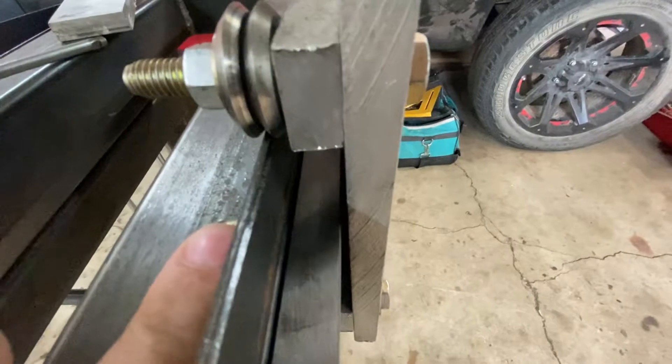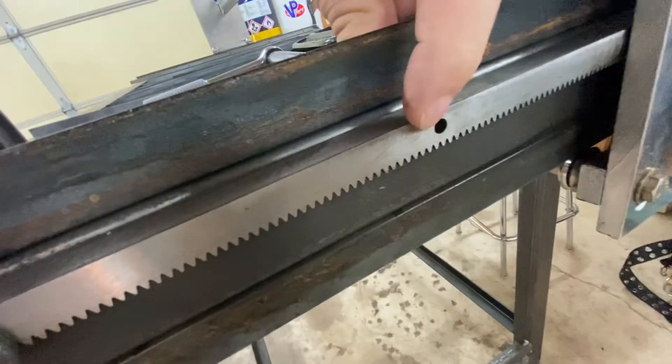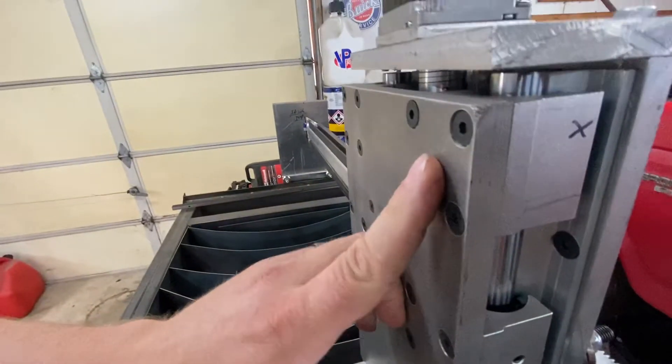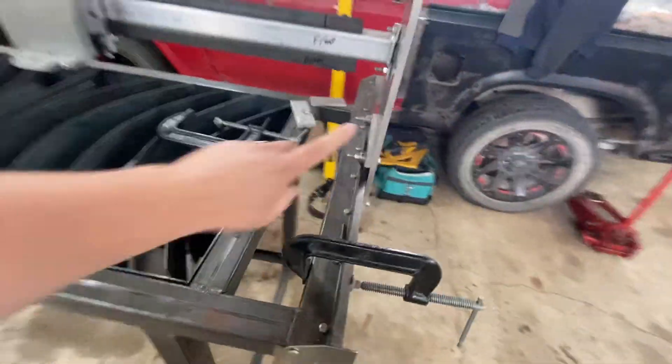Okay, so it's a new day. I took a run to the hardware store to find some bolts that would work for this, and lo and behold, nowhere in the town closest to me has the kind I'm looking for. Some things I overlooked when I was designing this — it was all up here and a few doodles on paper. I'm running terribly tight to that gear rack between this plate and the gear rack, so I need to countersink these holes and get some flat machine head screws. They're V'd at the bottom and flat on the top for an Allen head — so I need to go to the city, half an hour down the road, which has a good bolt selection.